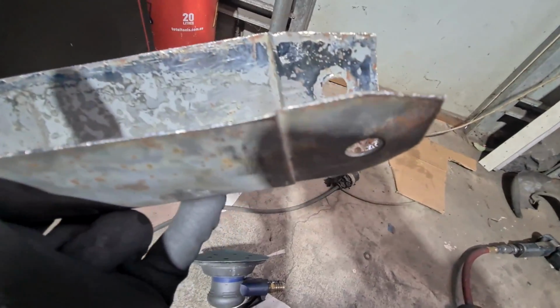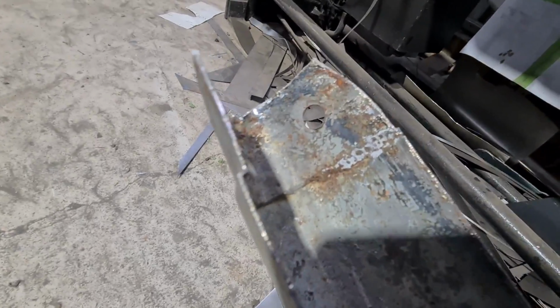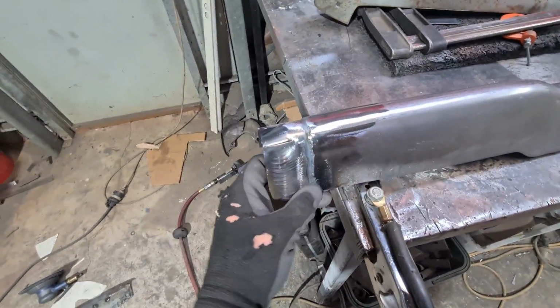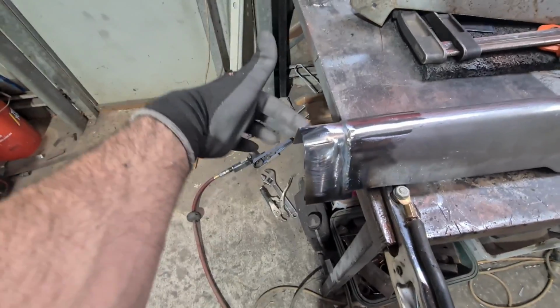can drill my holes, because the step down is pressed on one side, and it's obviously split, maybe at the factory or something, because there's a weld on this. So I'm assuming it's split from the factory and they pressed it, maybe just welded it up as a little safe keep. So obviously no way I can press that, so I have to make it by slipping a piece on the inside, TIGing it, and then cutting that step down.